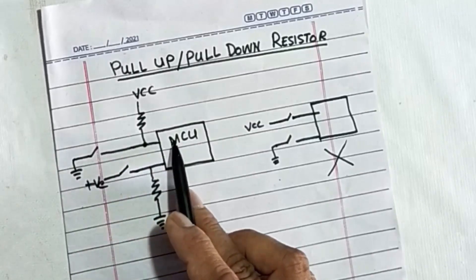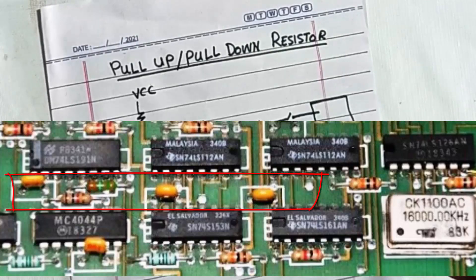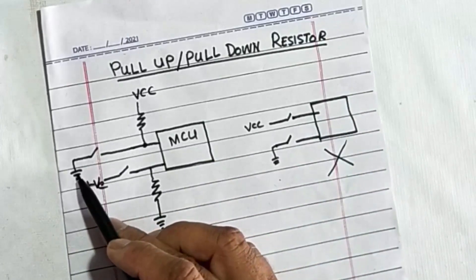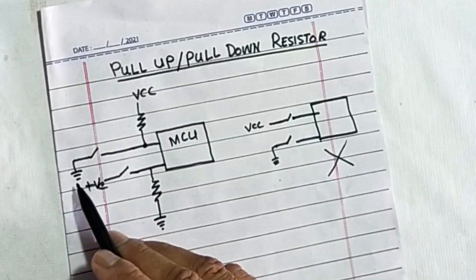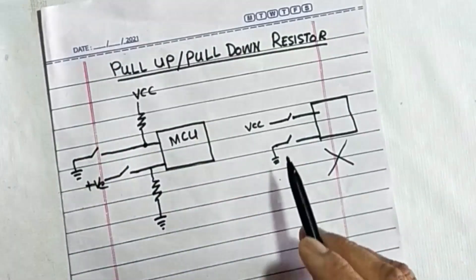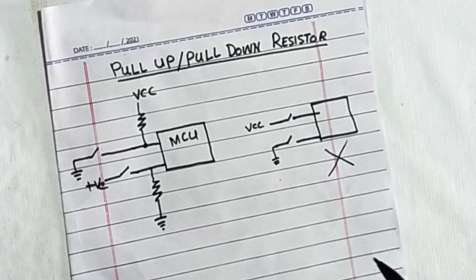This is the reason: when we need to connect a ground signal, this signal will apply directly to the microcontroller. But whenever I open this switch, this line will pull up directly to VCC. In all electronic circuits, ripple removal capacitors are connected between VCC and ground to eliminate harmonics and ripples. So when this pin is disconnected it is pulled to VCC, and the other pin is floating — floating input is not allowed in digital circuits.